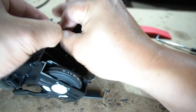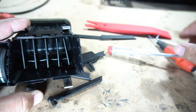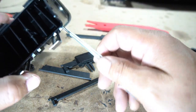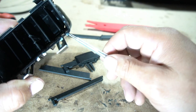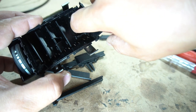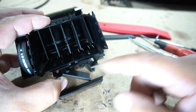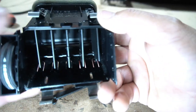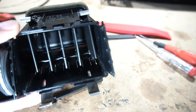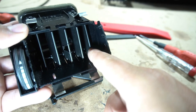Let me give you a demonstration — I'm going to take one out. That's one. You notice how it's sitting on an angle now — that's because I've just knocked it out of its socket. Now I'm going to go in from the bottom here and pry off the bottom one. There you go — that louver is now completely loose. Repeat the same thing, take them out of their slots and they will all come out. Make sure that when you reinstall them, you line up the louvers with the bracket and then push them into the appropriate holes.